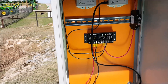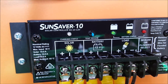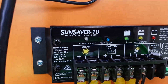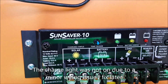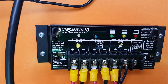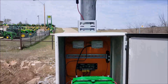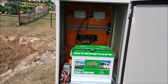The wiring is complete — it runs from the solar connections on the charge controller down through the grommets, up hugging the pole, to the MC4 connectors, which connect rainproof and elements-proof up to the solar panel. Let's connect the battery and get it charging. It's all set — the green light is on, the battery has a good status. I had a little connection problem but got it fixed, and it's charging now. Voltages are all good. I still need to tidy up the wiring a bit but I'll leave that for another time. Thanks for watching, see you next time.